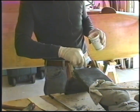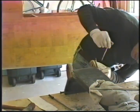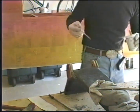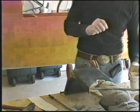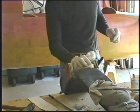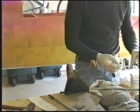If you thought you got any lubricant on the surfaces of the inside of these bushing holes, I hope you washed them out with lacquer thinner or MEK and just be absolutely certain there was no residual lubricant left. Now, if you feel particularly sloppy or are considered sloppy and you can't control yourself that way, don't use WD-40, because if you get it on the surfaces, you'll never get all of it off. WD-40 has silicone in it, or so I've been told, and I do know that about silicone. Hard to get off.